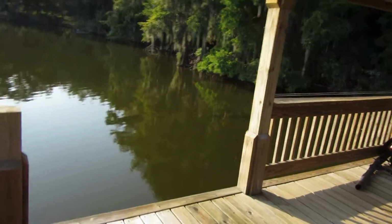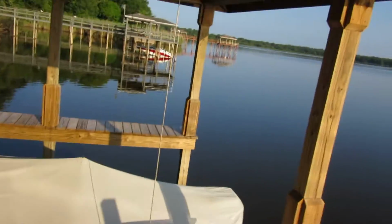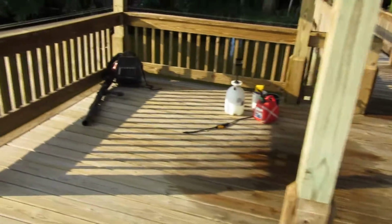The wider you can get these pores open, the more it'll accept the stain. The more stain you can get into the wood and keep it moistened, the more that stops the wood from drying out and splitting and everything else. It also promotes adhesion, so you don't have to worry about the stain wearing off or flaking off as fast. Well, with the stain we use, there's no flaking.